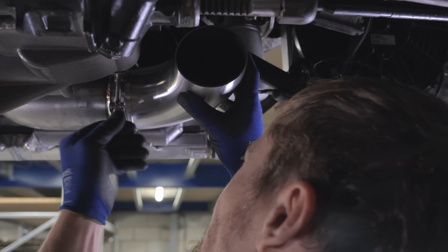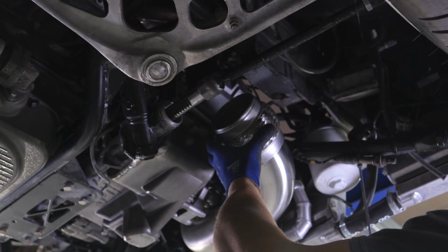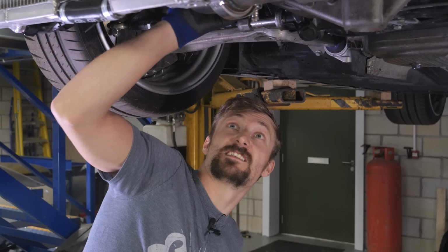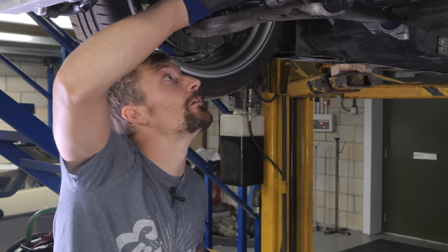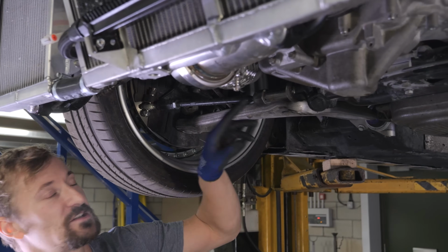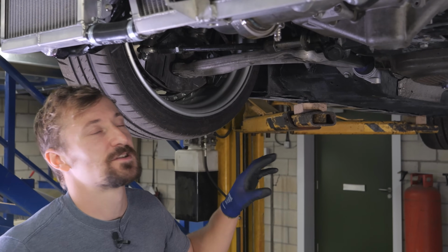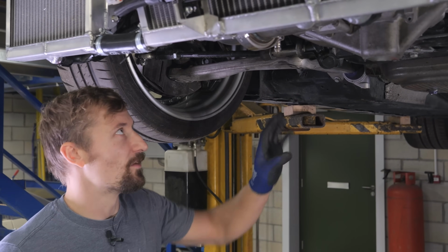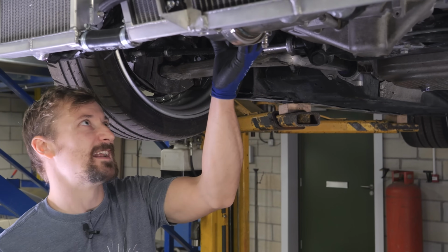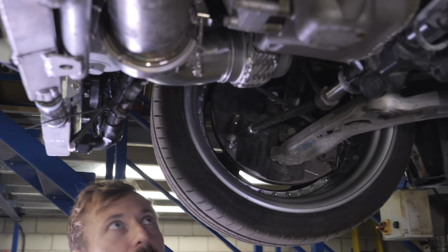So what I'll do now is get the ends of that brushed up, place that flexi over there where I want it, and mark it, because obviously I'm going to put it on here at a slight angle, so it's pointed exactly where I want it to go. Tack it on, and then think about how I'm going to get over this header primary, engine mount, steering column conundrum, because 3.5 inch does fit through there, but only just. So I think we might have to come up with a bit of an engineering solution for that, maybe creating a fixed section on the engine block, but we'll get to that in a minute. Like I say, I'll get the ends of this brushed up, get it marked, get it tacked, and then we're ready to go.